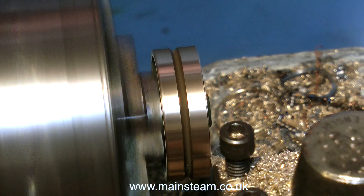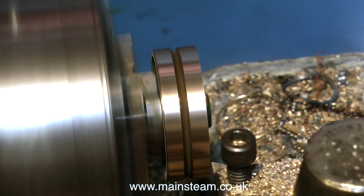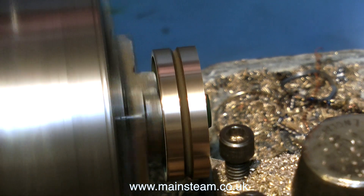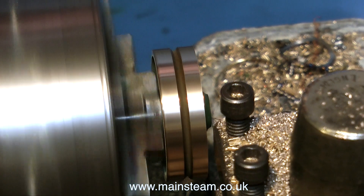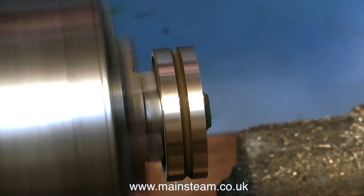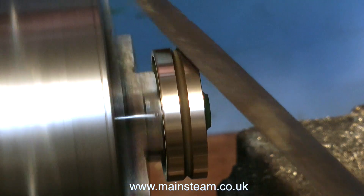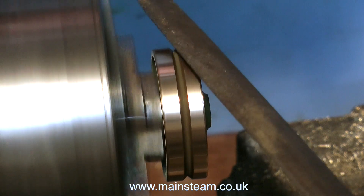You do need to have an excess of patience for jobs like this, but it's quite rewarding at the end when not only does the engine run well, it looks good too. In exactly the same way as with the other side, I'm taking a facing cut off the centre boss. I'm using a file to finish off and get rid of any sharp edges. When filing in the lathe, be very careful not to catch the file in the chuck.